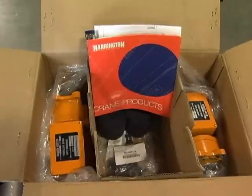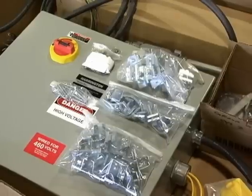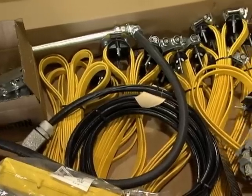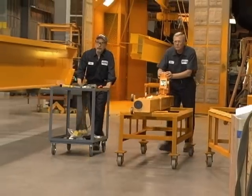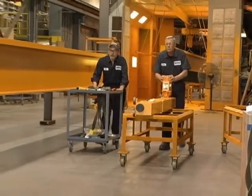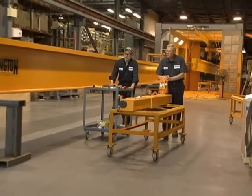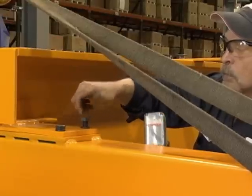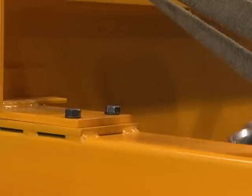Owner's manuals shipped with your system include: wiring diagram, crane assembly prints, all parts list, MSDS sheets, CMAA operator's manual, warranty brochure, original order acknowledgement, and installation manuals. Your crane system consists of two major assembly components: mechanical assembly and electrical assembly. Your mechanical assembly typically has pre-drilled components for bolted connections. On most systems, no cutting, drilling, or tapping is required and all fasteners are included. Prior to assembly, ensure you have a clean and efficient work environment. Per the owner's manual, attach your top running or underhung end trucks to the bridge beam. Note that holes are pre-drilled and connection is bolted.